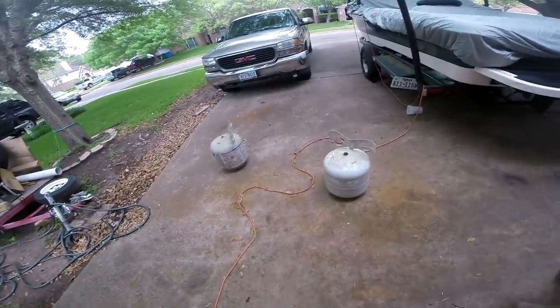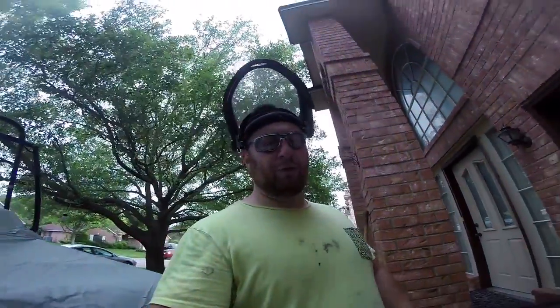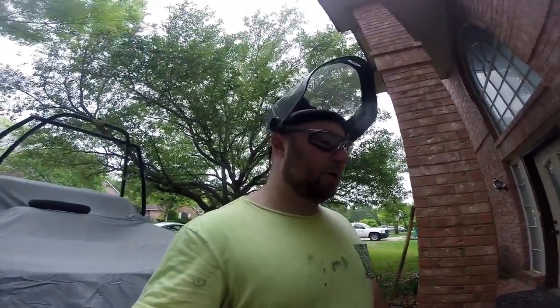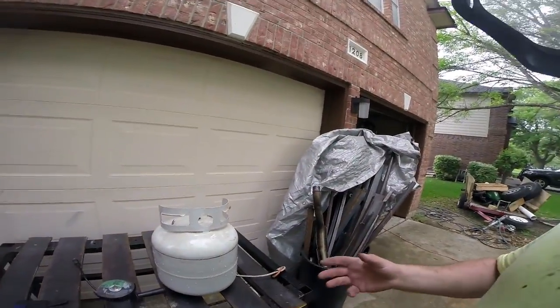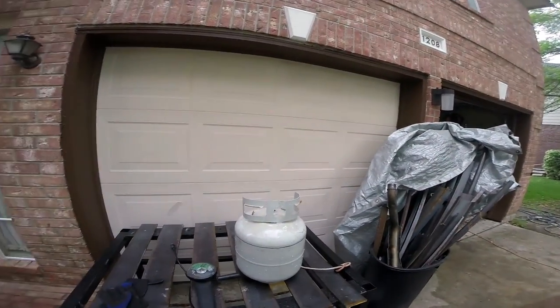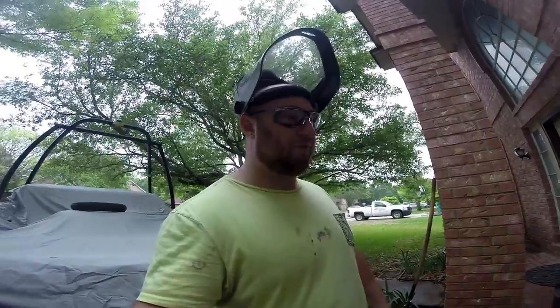For those of you who think you can just burn off the propane and cut in — those are burning propane tanks and they're almost gone out after just a minute, so they're completely empty. But here's a simple test: when you fill this up with water, you'll see a heat-shimmer cloud above it from gas refraction in the atmosphere — showing you that you've displaced a ton of propane out of this jug just by filling it with water, even though we burnt it off only five minutes ago. So please, please make sure you fill this with water before you attempt to cut it. I'll be wearing gloves, safety glasses, and a face shield, and we're gonna go nice and slow.